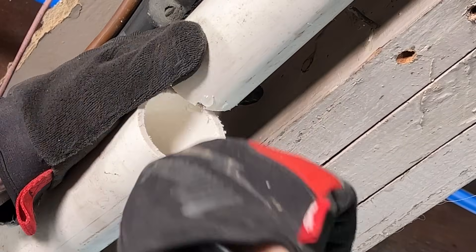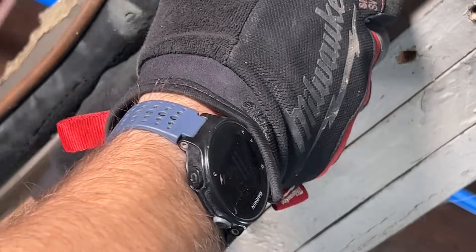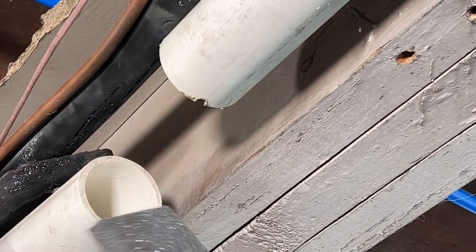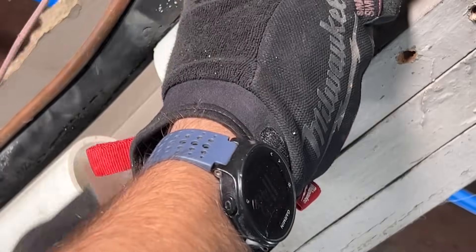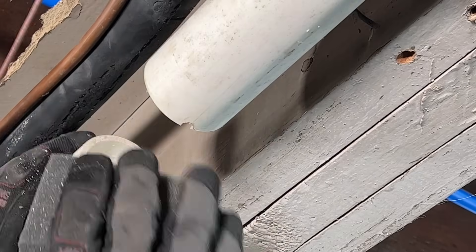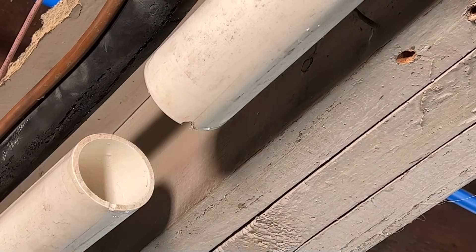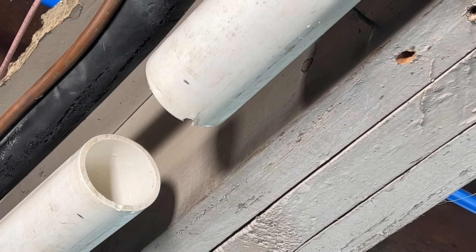Once that's done, since I have gloves on, I'm just going to deburr with my gloves — smoothing the inside and outside — which will easily take all the PVC shavings or burrs off the pipe. Since we're doing the push-to-fit, it does come with sandpaper. You'll sand the outside edges, creating a chamfer, which will make the pipe easier to insert into the fitting. Then you need some type of lubricant — all I'm using is dish soap — putting it around each of the outsides. Then mark one inch so you know when you've reached full depth within the coupling.